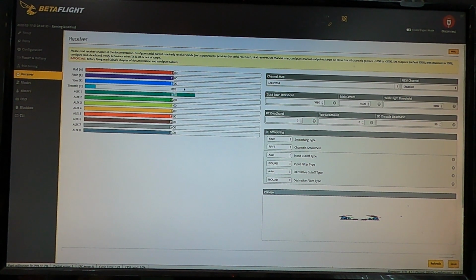Spektrum radios, I know I have to turn my travel up in all my channels. And then sometimes you have to go in and reverse and correct some channels too. So you want to check that is all correct here. That when you roll left, it moves left. When you pitch forward, it moves forward. And when you yaw right, it moves right.